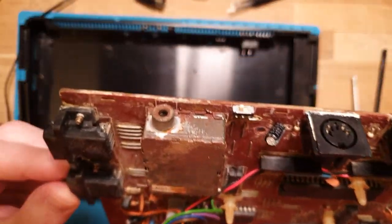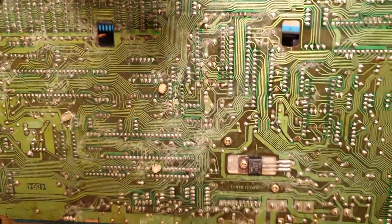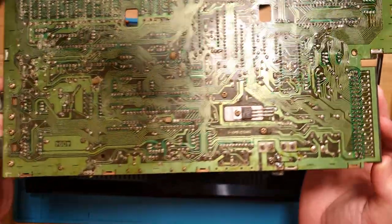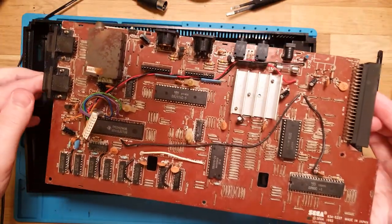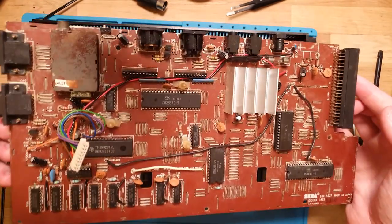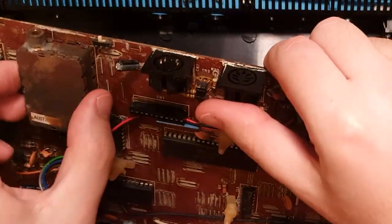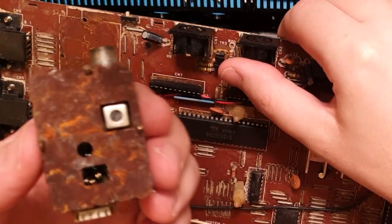It's filthy. Look at that rust around the board here. And yeah, the bottom is just terrible. So I'm going to take this, give it a good hit with some PCB cleaning fluid, which will get rid of all this scunge safely, and some distilled water, and then a nice alcohol bath to press all the water out so that we can get rid of all this rust and corrosion and have a good clean slate to start with.